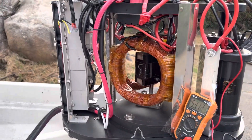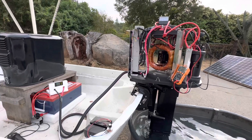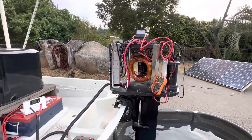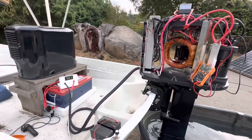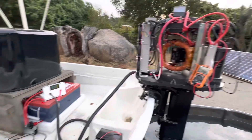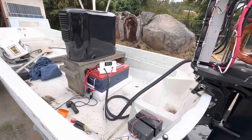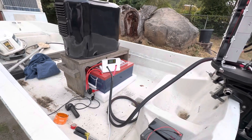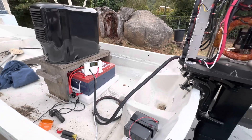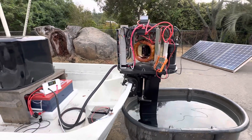Let's turn this back down. So as you guys could see, on the lower power end we could get up to close to 60% recovery — from 2 amps up to about 10 amps — then it goes down to about 40%, and then down to about 20% once you get up to full power. When this motor is running at 5 amps from the battery, the motor is actually consuming 10 amps, so you're getting a lot more power out than what the battery is doing. Without this system we'd be doing 10 amps out of the battery. At 5 amps you've got basically 20 hours of run time versus 10 hours at full draw. At lower speeds we could double the distance off that small battery. Pretty neat — let me know in the comments what you think, thanks for watching.